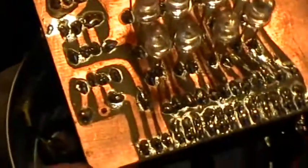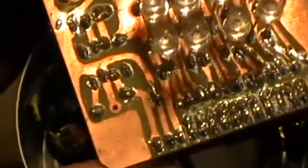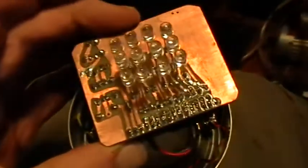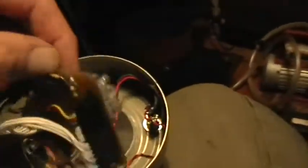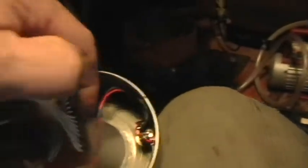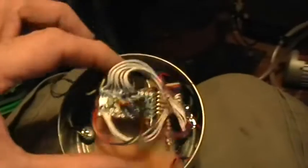I'm getting pretty good at making these little sketched printed circuit boards. It's not beautiful but it works. Turns out that an ordinary Sharpie marker — you don't have to get the super industrial-strength kind — works just fine with the ferric chloride etchant system. You can sketch your circuit and it'll work.